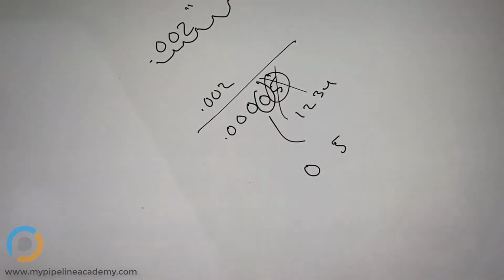And that fourth digit is 10,000ths of an inch, and certainly there are applications, like, for example, if you wanted to press fit a shaft into a ball bearing, into the inner race of a ball bearing or something like that, you would want to be able to measure down to 10,000ths of an inch. Sometimes when measuring really thin films, you'll also want to have that kind of resolution.